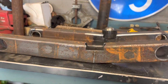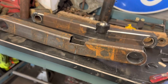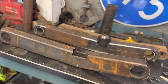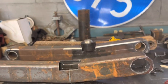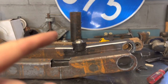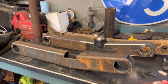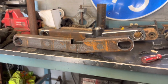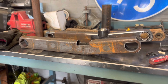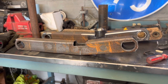Alright, that is a very rough take on how to do these. Again, this isn't the gospel — this is just how I did it. I got them as close as I possibly can; they're pretty true from one to the other. At the end of the day it's an adjustable suspension, so things are going to change and move. I'm going to take some time and grind them up, get them nice and clean, cut the sleeves, and then start tacking everything together.